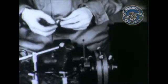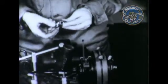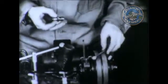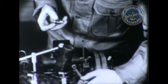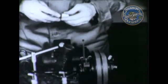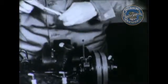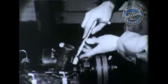The action of the universal joint can be compared to that of your wrist. When you have to reach a nut in a hard-to-get-at place, around or over an obstruction, the universal joint is the attachment to use. Whenever possible, break the nut loose with another type of wrench, and for speed, remove it with the aid of the universal joint.